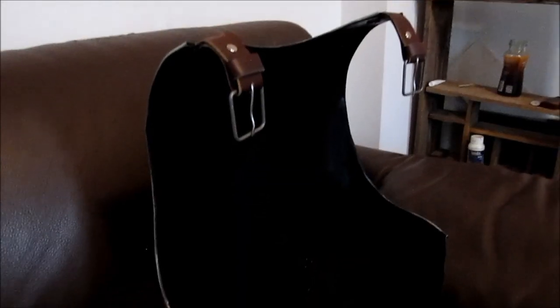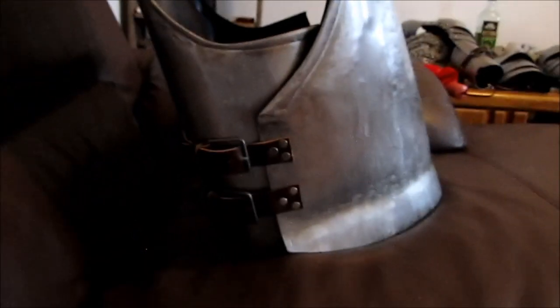For dishing it out, I used a tree stump that I hammered a ball into, and used that as a working surface when making the breastplate and backplate. The backplate is actually 22-gauge mild steel — I chose 22-gauge instead of 18-gauge because I wasn't able to cut 18-gauge myself, and having the supplier cut it cost extra money. Since I'm not fighting in this armor and it's just for decoration, 22-gauge was fine.